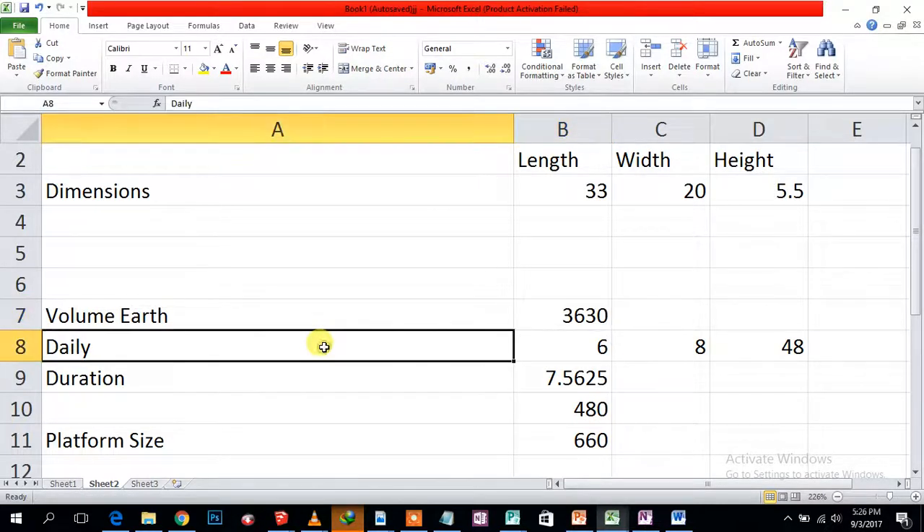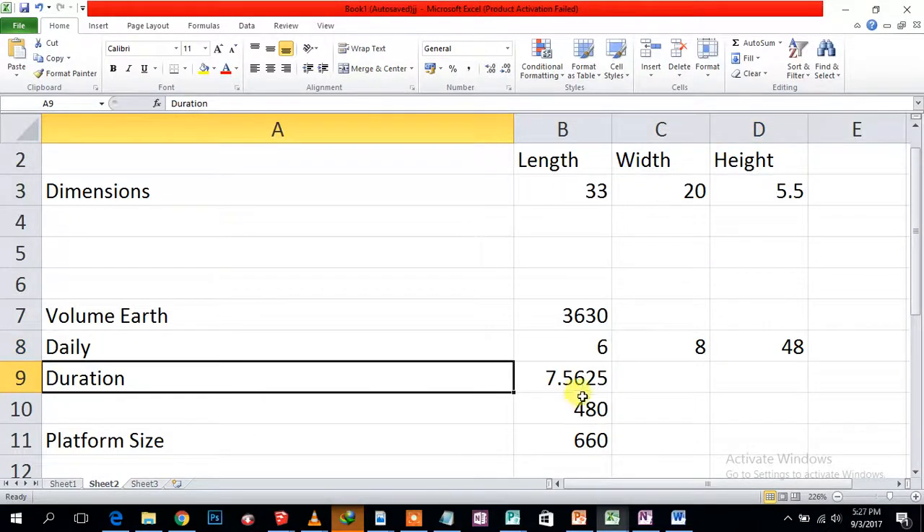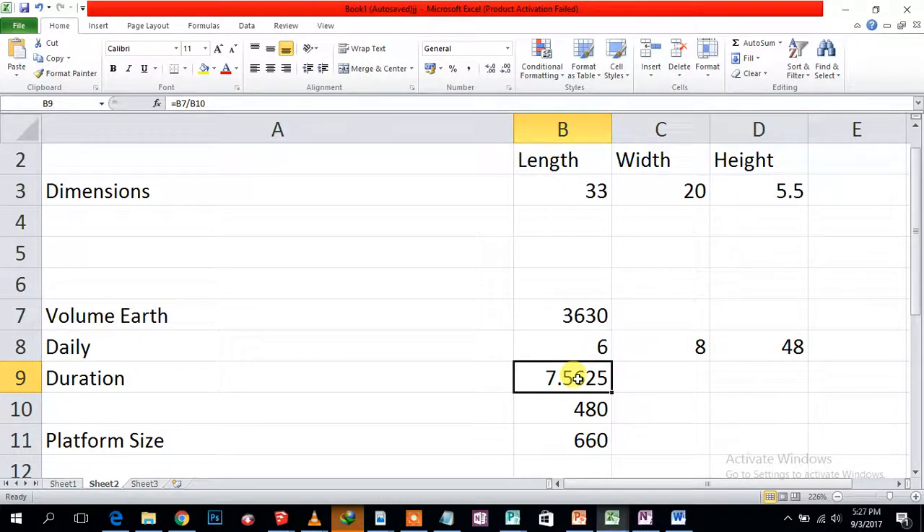It's a big job. If we get six trucks in a day and each makes eight trips, we can bring about 480 tons in a day, which is quite impressive and will go very fast. The desired amount is 3,600 cubic meters, so using that formula it will take about seven to seven and a half days to fill up.